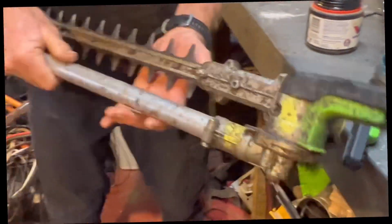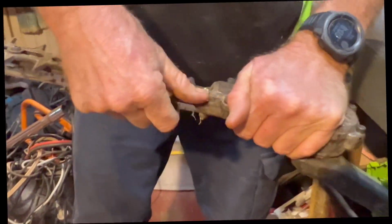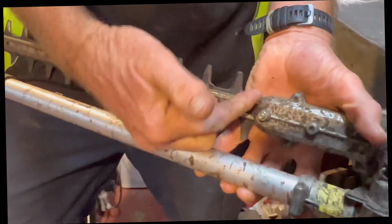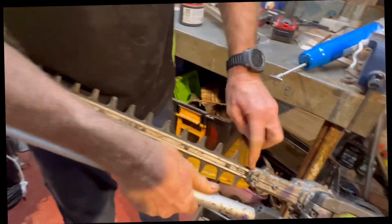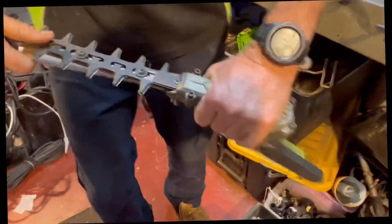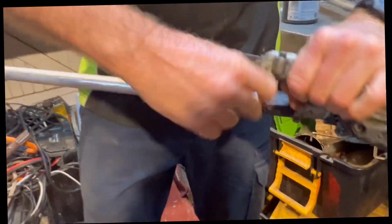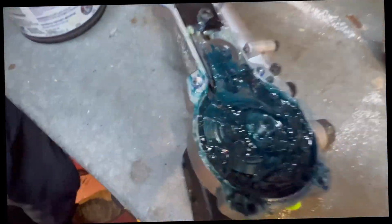You have this stick, but over time sometimes it'll actually become quite loose in this one here. So what I've done is I will put a larger bolt going all the way through, with a wing nut, so when it does loosen off, I can tighten that up. Otherwise, that there will bend, become quite loose and wobbly, and potentially become fatal.